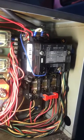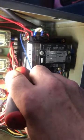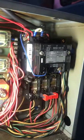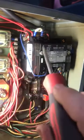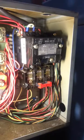This is eBay 4429, a size double-O motor starter. When I push the start button, it starts and stops intermittently. We can see our number three-to-two switch back here — if I manually depress that it starts and stops, but if I let go it stops. That switch has a little issue where it's not being depressed all the way. When I push the start button it runs, so we've got a problem with our three-to-two switch.